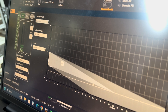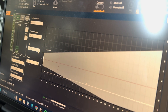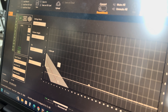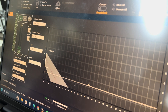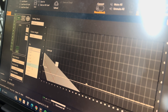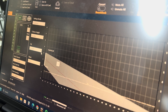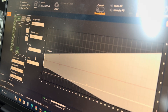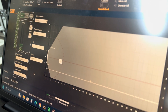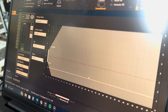If you don't like easy focus or easy beam, you've got free beam. We're at two meters — we'll keep it at that. You can tilt this however you want. So if we tilted it down 30 degrees, you can see the cabinet is actually shooting down 30 degrees. We can make our beam angle be 15 or 30 degrees. If we do zero degrees it will be straight forward, and you can go as far as a 90-degree coverage pattern, which is kind of insane. Lots of options with this speaker.